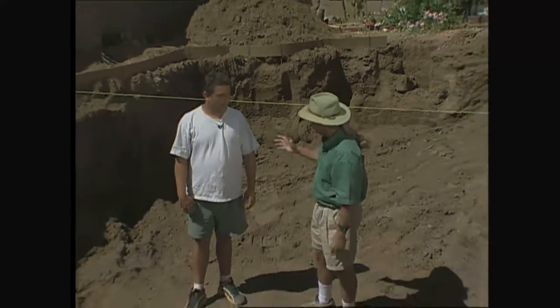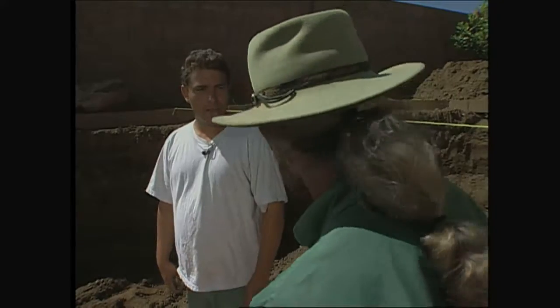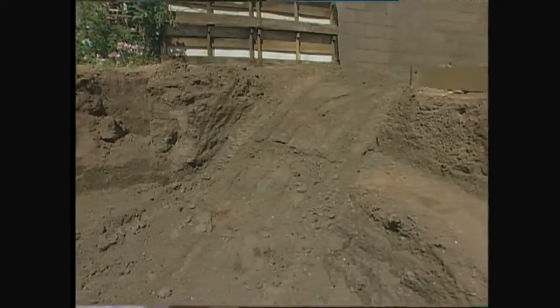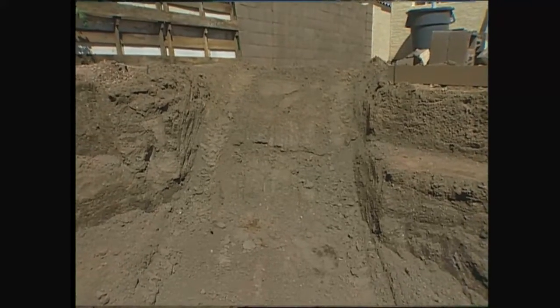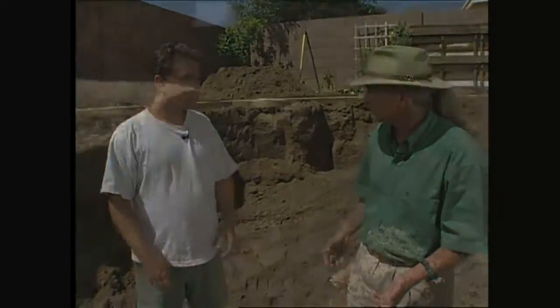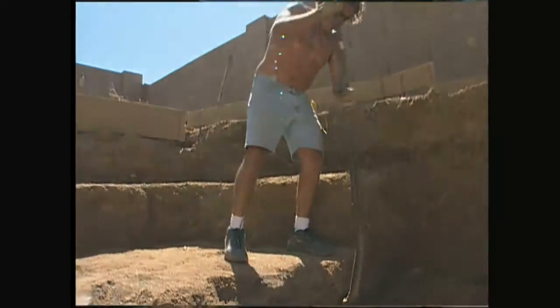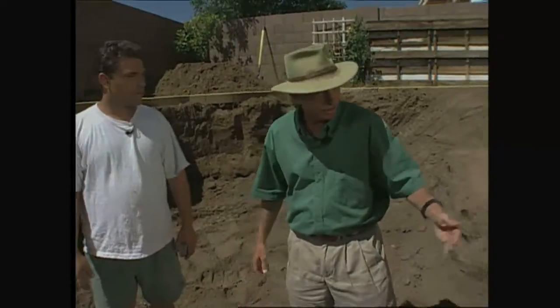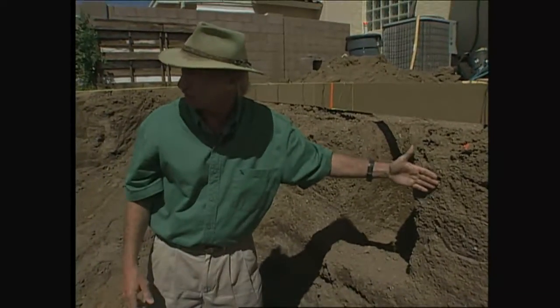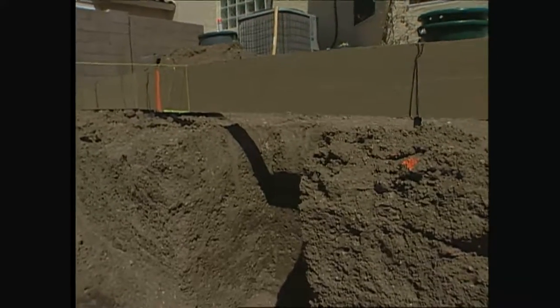I'm down here in the bottom of the pool we've been digging with Mike Matzdorf from DLM Excavation. Mike, you dug most of this with a bobcat, and you left a ramp over there for the bobcat to get in and out — but what are you going to do with that ramp? We're going to sandbag that and reform the wall so you can finish it off. You also have to do a lot of hand shaping with the shovels — what's the purpose of that? So we can have the bench and the correct depth for the spa, the steps, and all that. Now, we laid this pool out six inches wider than what you've dug — and of course that's for the thickness of the wall itself. But what is this formboard for? The formboard for shotcrete goes to the top so the rebar gives everybody a reference to measure from.